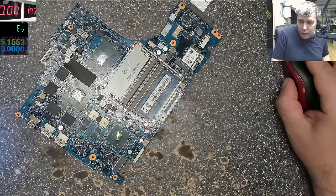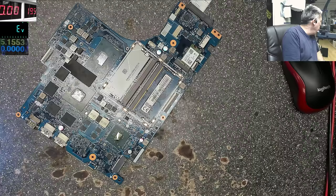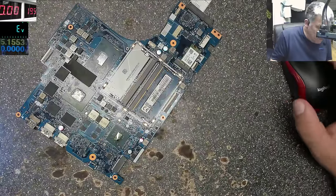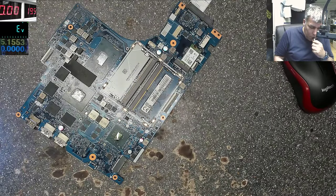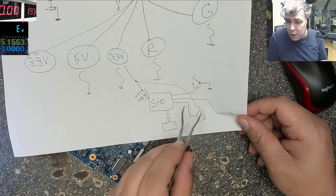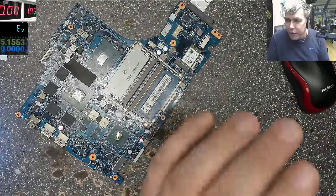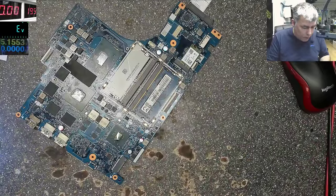One sec, give me 1 second. Okay. So we know. It's okay. We have a short on 3.3 volts here. We have a short on the 3.3 volts power rail. What we can do, because we can find it, okay, let's find it, just to make you happy. Let's find the 3.3 volts power rail. It probably is getting hot. That's easy to find.